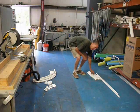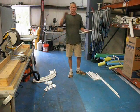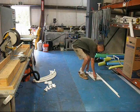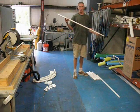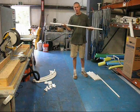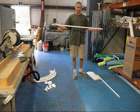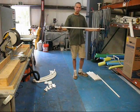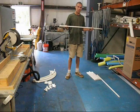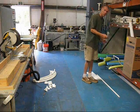I also have nine pieces cut to 22 and a half inches, which ensures everything ends up 24 inches on center so that when you use a cover material — if you're using four-by-eight foot sheets — you'll have even break points without much cutting. The end pieces are 50 inches long, which is what came out of the arc I'm working with. You want to find that number after you've made your bends, dry-fitting a couple pieces together to confirm the actual amount. These end pieces are what allow you to drain the system easily when freezing temperatures are coming.